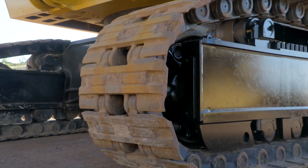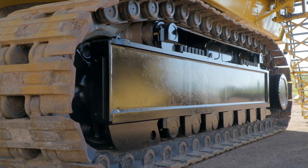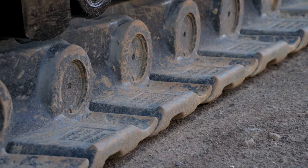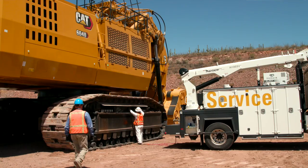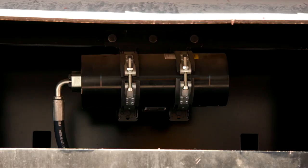The 6040 comes standard with 1200 millimeter heavy-duty track pads. The new CAT heavy-duty tracks improve handling of high field loads and have reduced pitch extension wear to increase track chain life by 20 to 40%. Fully hydraulic, this machine comes standard with a self-adjusting track tensioning system with a piston accumulator.